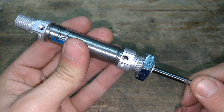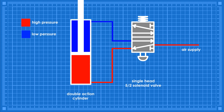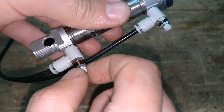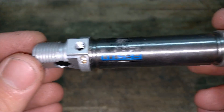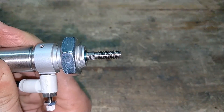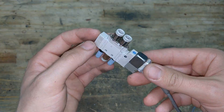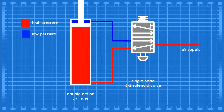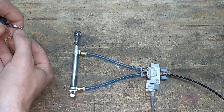Let's talk about pneumatic cylinders for a sec. In very basic terms, the way these work is compressed air pushes a piston back and forth. If compressed air is forced through the bottom orifice, the piston comes out, and if air is forced through the top orifice, the piston goes back in. These valves are used to reduce airflow, giving you control over the piston's speed. For this particular prop, I purchased Festo adjustable cushioning cylinders. These have shock absorbers built into them so that the piston slows down near the end of its travel — you can see that in slow motion right here. This makes the animatronic a lot smoother and significantly improves its lifespan. This is a single-head 5-2-way solenoid valve. These use an electrical current to switch the compressed air from one tube to the other and to vent the exhaust. This means that in this tubing configuration, when 24 volts is applied to the valve the piston comes out, and when 24 volts are removed the piston goes back in.